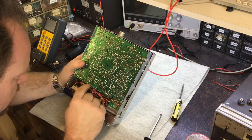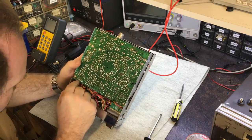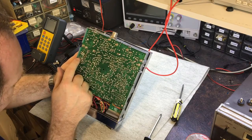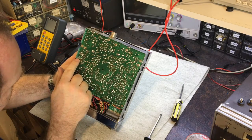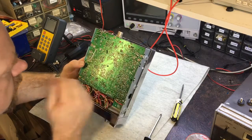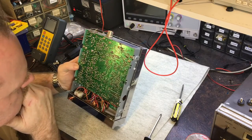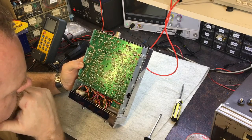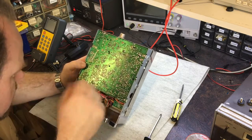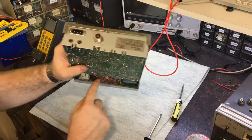It's quite interesting. Bit of bad soldering over here, bit of flux residue. Flux over here. There's a bridge between these tracks here. Right there. What's that? Oh yeah, there's a capacitor across there. So interesting way of doing it. But it's much like most other 29s, and there's a little diode across there. They just changed the manufacturing process very slightly to meet the newer demands.